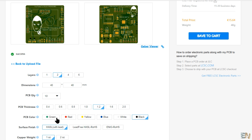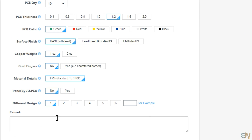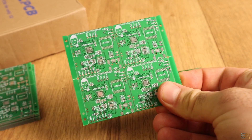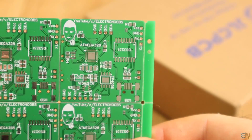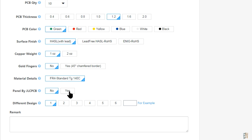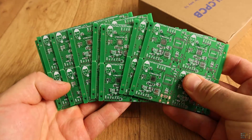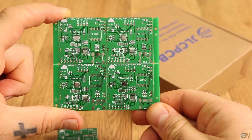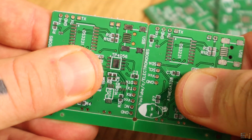I'm going to show you a trick to get more boards for the same price. If your boards are under 40x40mm, you could merge more boards together into one panel and pay the same price. The board must be below 40x40mm because there is a margin of 10mm for the panel. Select yes to the panel option and enter the amount of boards for the X and Y directions. In my case it's 2 by 2 boards, so a total of 4 boards on one panel. Now I'll get 40 boards for $2 — amazing! You will receive the boards with a 10mm margin and the boards are already cut; all you have to do is bend it a little and the board will snap out.